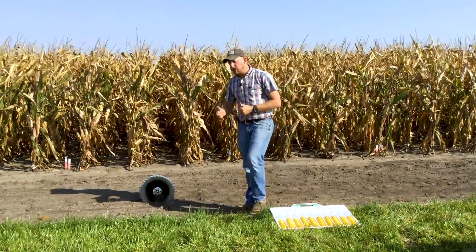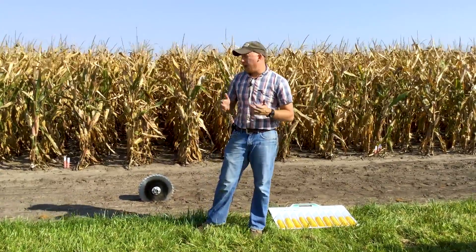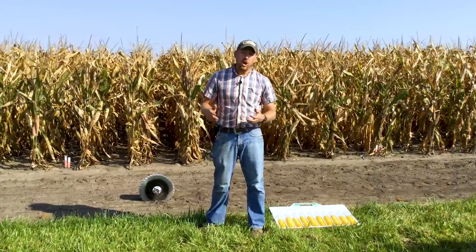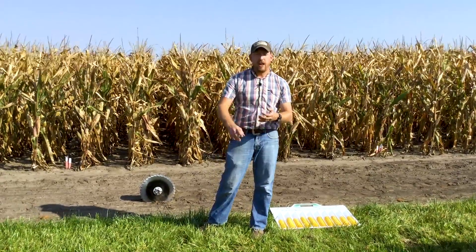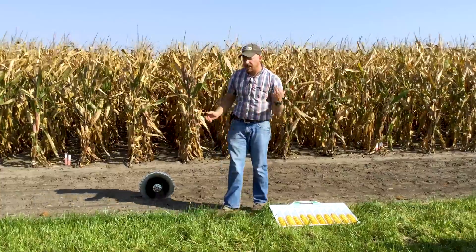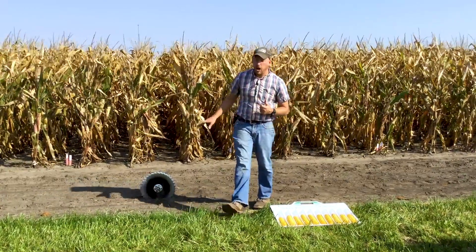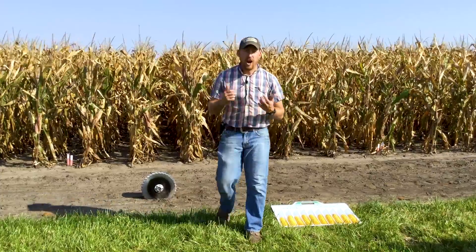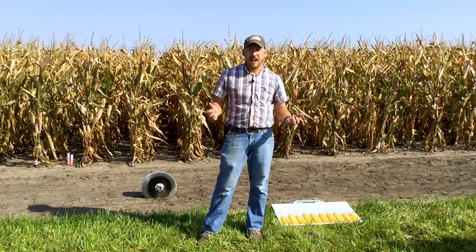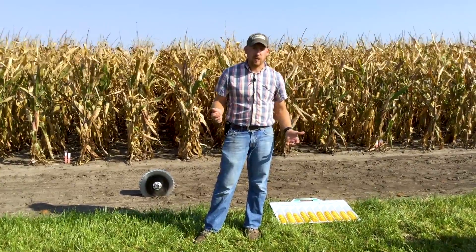Those questions entailed how do they work. This being no-till, this was the first plot we planted in 2020 and I did plant it in probably semi-marginal conditions. Walking behind the planter and peeling open that seed trench, I did realize something I did not see last year. In the marginal conditions, the STP openers do a really good job of lifting and fracturing that sidewall, whereas with the standard disc openers I just saw a lot of smearing of that sidewall.